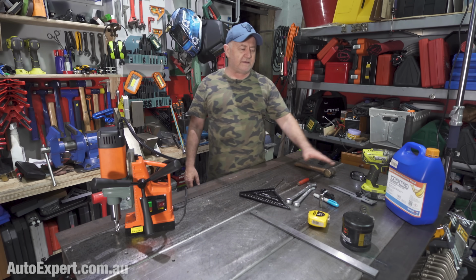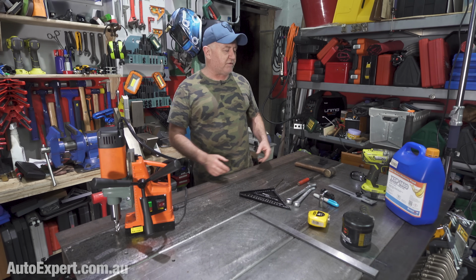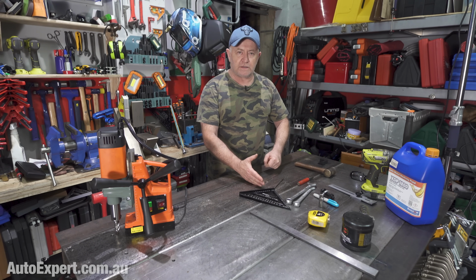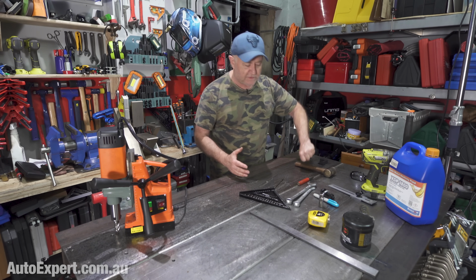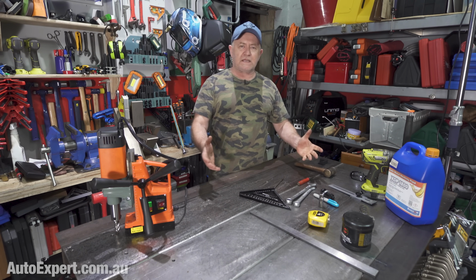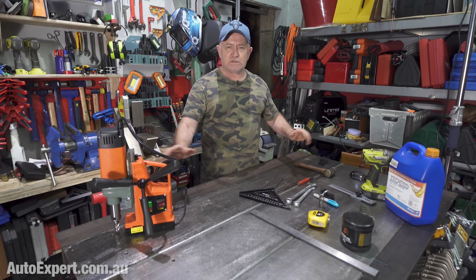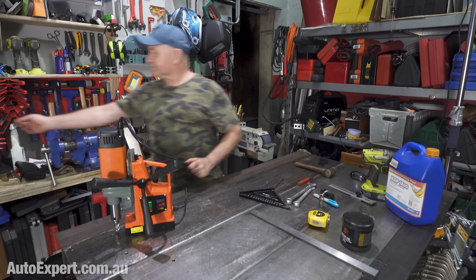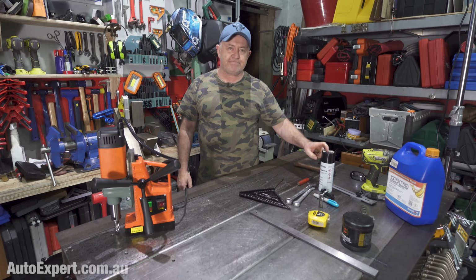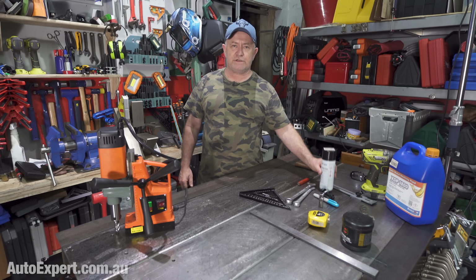It also turns the whole table into the ground for a welding operation, which is really nice if you're moving from here to here and over there, or you're doing a lot of the same sort of work. You're getting this thing and putting it down here, you can just weld it, right? You don't have to put it down here and grab the earth clamp and connect it to the job and take it off and then remove the part and get a new part and put it down here, grab the clamp and put it on, repeat. It makes it much easier just to go, bit of a lightsaber, put that away, grab the next one, because it's all energized, baby. If you do that though, got to be really careful about putting pressure pack cans on the surface, because that's grounded too. And the last thing you want to do with your electrode holder is that, because next stop, the burns unit. Don't do that.